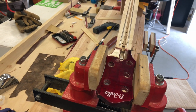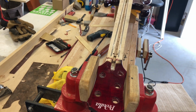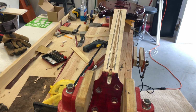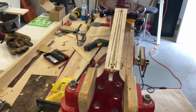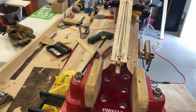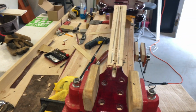blend it like you can with lacquer, so I'm going to have to sand the whole thing down, rough it up, touch up where there's some whiskey bumps on it, and then reshoot the clear, wet sand and buff it out. But it should be playable then, and it should look like $1 million, and then we'll move on to the next job.